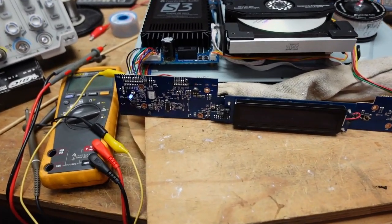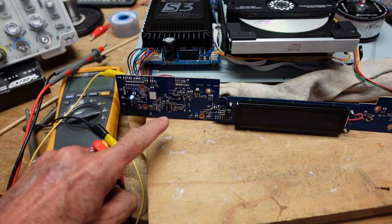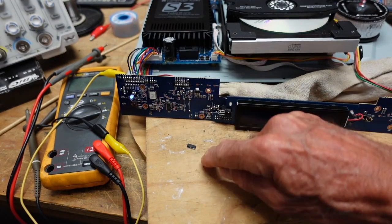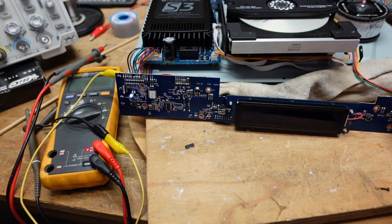I did check to make sure that my shift register was getting strobe pulses and was putting out pulses at other pins, and it is. I had the orientation right — fortunately they marked pin one on the IC; the old one did not have that for whatever reason. Now all the functions work. I can press play here on the front panel.